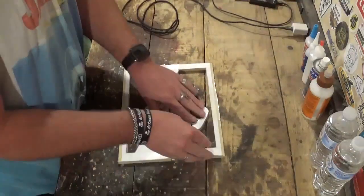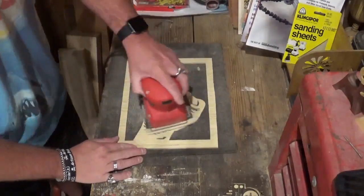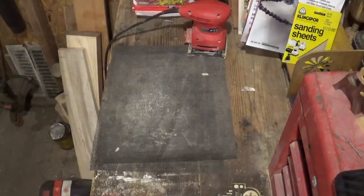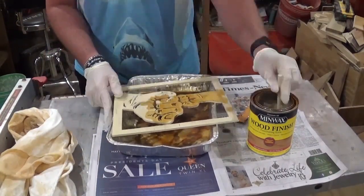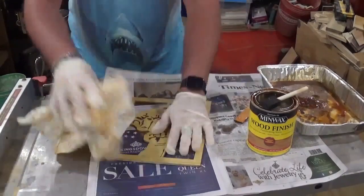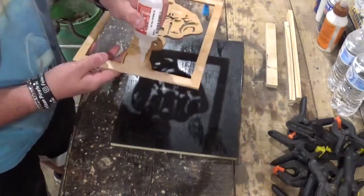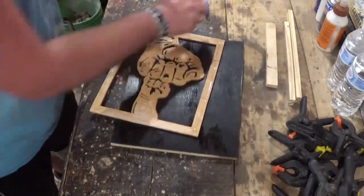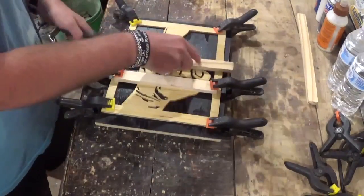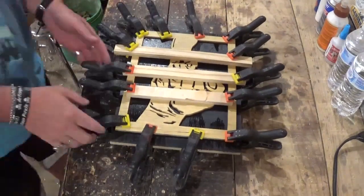Finishing up with the final interior cut, then we'll release both pieces from the waste material by following along the straight lines. I eyeballed and drew out what I thought would be a decent-sized border all the way around. Now that all the scroll work is done, we remove the pattern from the waste wood and proceed to sanding — using 180-grit sandpaper in the palm sander on the front and back. Then it was time to stain with Minwax wood stain, saturating all areas and wiping off the excess with t-shirt material. For the glue-up I used medium-grade CA glue and activator, spring clamps, and strips of wood to add pressure to the center details.